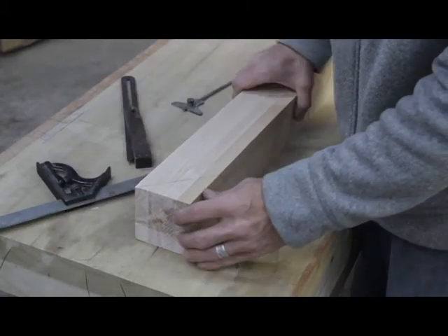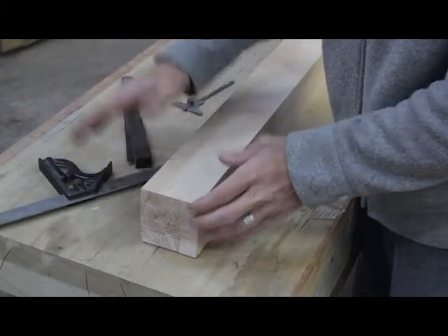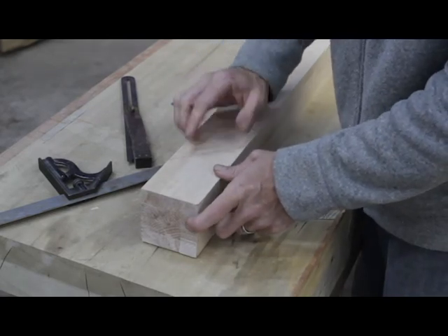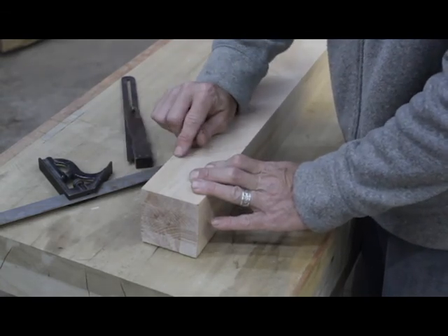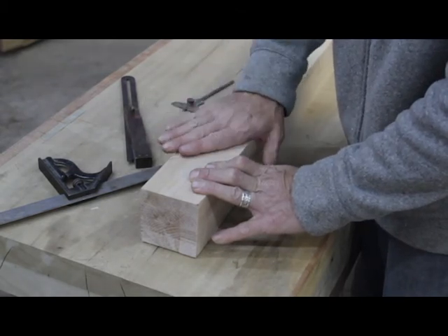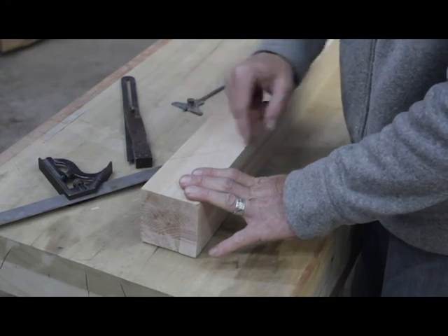45. Compounded. 45. It'll compress a little bit when you push down on that table. I normally put some leather or felt pads on the bottom and that takes that up a little bit, but I may be about a half a degree off of 45 as a result when I mark it. But I'll still cut that at a 45. So there you have it. That's what the angle is — it's a 45, 45.